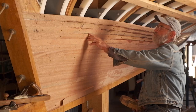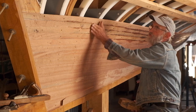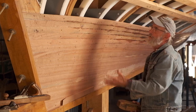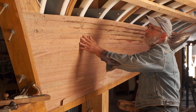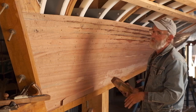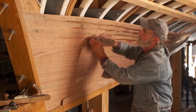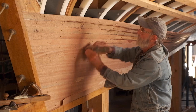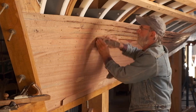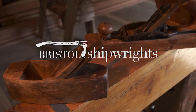You can see the planking lines or the glue lines start to disappear as I get down close. What I'm doing is hollowing this whole area right here because it's in an inside curve — what they call a footer curve. I'm planing it down until these glue lines just start to disappear; that gives me my grade in this direction. Then I'll pick up another plane and work it in other ways. Doesn't that look nice?